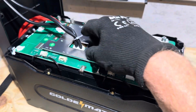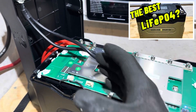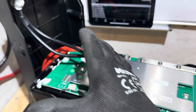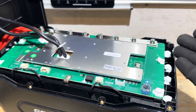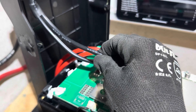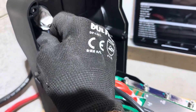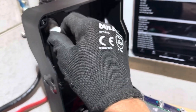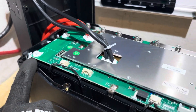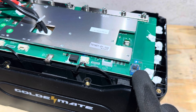Here's a better look at the battery. You can see a nice large BMS heat sink inside — it's like déjà vu opening this battery; it looks just like the Golden Mate Orion 1000, minus the display on top. Pretty sure this is the exact same BMS and build — they just swapped the top cover for a strap instead of two side handles. Dual number-8, 200-degree jacketed leads on both negative and positive, with hydraulic crimp connections and adhesive to prevent loosening. There's a gasket and O-ring all around the top cover maintaining its IP67 rating. Bluetooth antenna is right here.